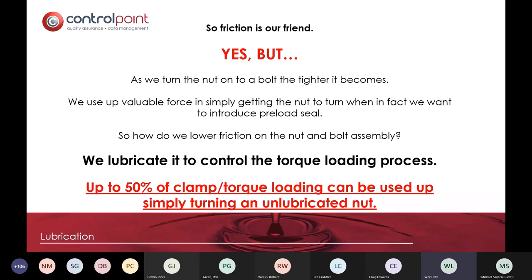So friction is a good thing in some ways, because as we turn the nut onto the bolt, it becomes tighter and begins to compress, as we've said earlier, the gasket, and it only compresses it by a few percentage of its actual total thickness. But unfortunately, we can achieve the torque, but not the tension. And that is because most of the friction is built up between the nut, the bolt, the washers, the threads. So you can lose up to 50% of your torque or clamp value